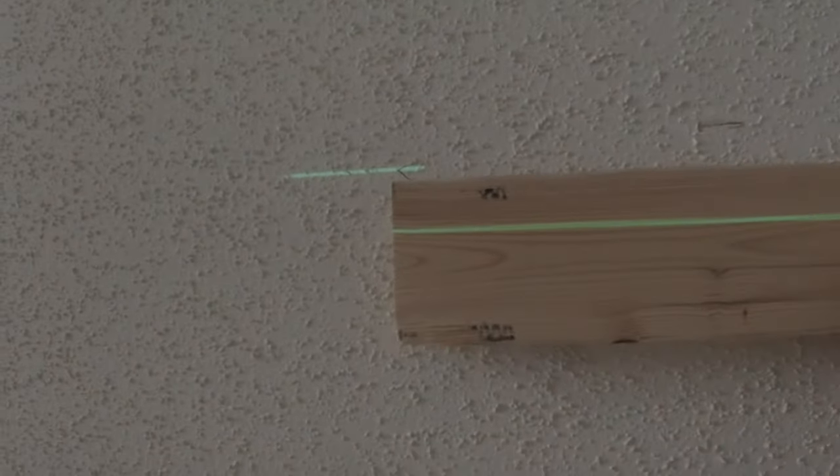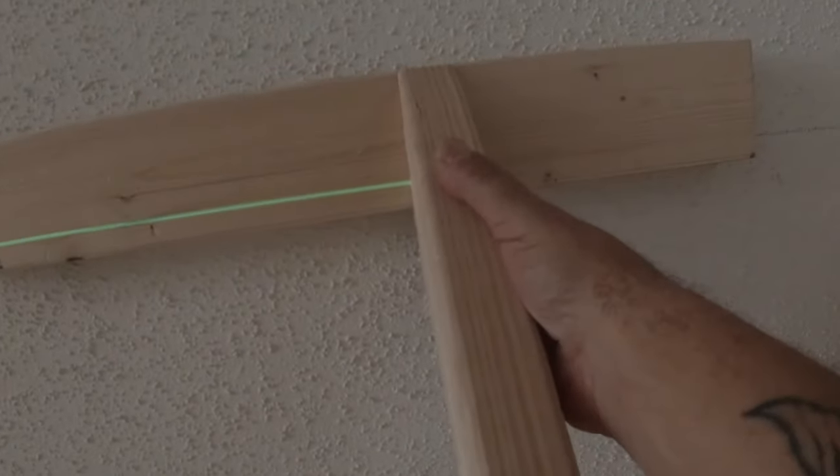And if I do it the other way and put a top plate, what happens is it's gonna stick out. Then I hit the door. So I'm just gonna go right to the studs, and then do a top plate like this.